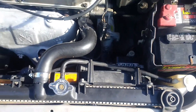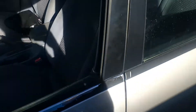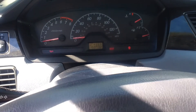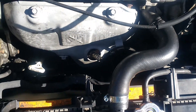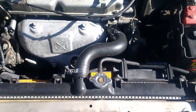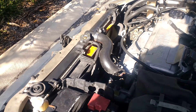The new controller is installed. The ignition is on and the fans are not turning — I'd call that fixed. The ultimate test is to start the engine, turn the AC on, and see if the fans come on. Ignition on, fans not running. Start her up. AC on — there we go, you can hear those fans turning big time. Shut the AC off and the fans are stopping. Awesome — that's fixed.